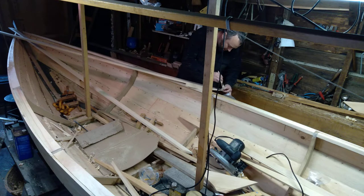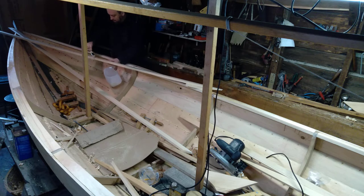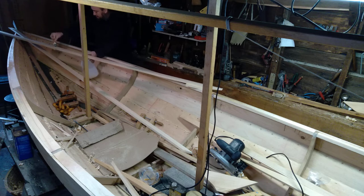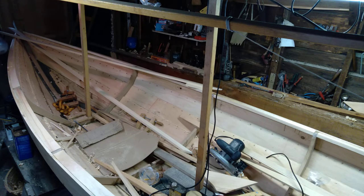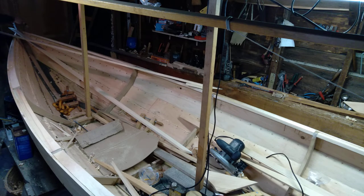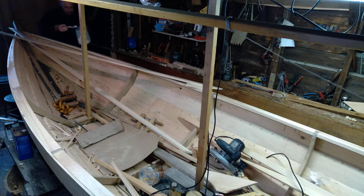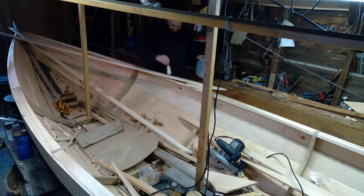So I'm just going along the top edge because the rail is 2 inches wide and the rail we're gluing to is 1 inch wide, so I'm only going to be gluing half of it. But then at the end, remember, we're going to be leaving the rail a little bit high so that it will taper. So we'll kind of swoop the glue joint down as we come along here. This glue is just adding a little extra strength to the whole assembly, because it's already going to be ring nailed with ring nails, so there's a lot of strength there.